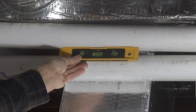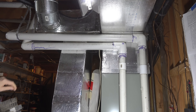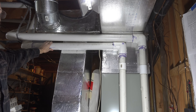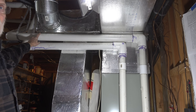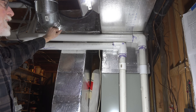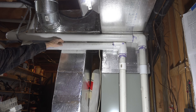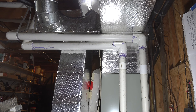That's on the combustion air inlet, and it's about the same — maybe a little more — on the venting. It's normal for the venting to have water in it because one of the byproducts of gas combustion is water. We're looking at the piping to see if there are any sags. A lot of times there will be a long run where the supports aren't close enough, creating a low spot. It doesn't take much — just a little bit of a low spot will cause waves as air goes through, shutting the pressure switch down.